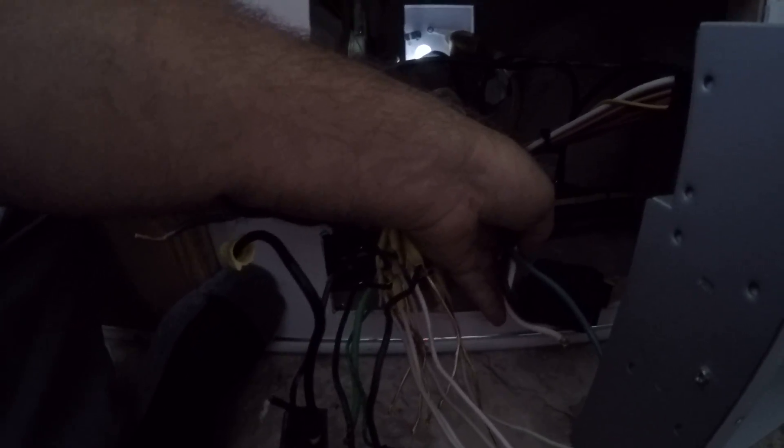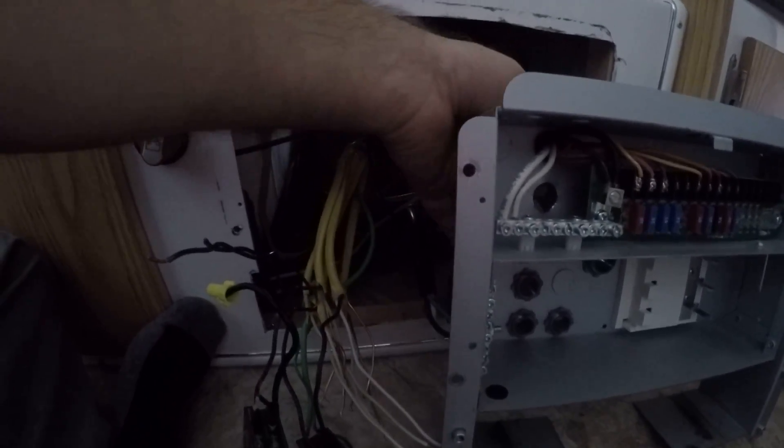So that I keep the same configuration that Casita had, I basically removed the breakers and then reattached the originals. I know the sequence and the order in which these will go into the new box. There are your strain reliefs and so forth — I've taken them loose. The last thing that will come is going to be the fuse panels. You can see they're wired up here at the top and I'll be taking them out last and moving them.